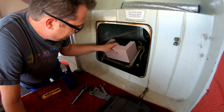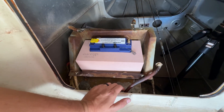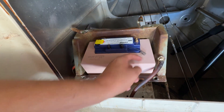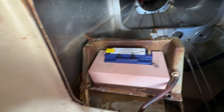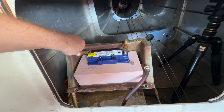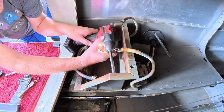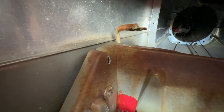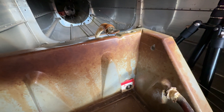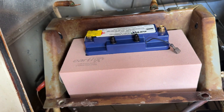So it's not hard from here. This is the old vent tube and we're going to be removing it — it's obviously terrible. We have to drill holes in the side of the box for the vent tubes to go out and then install grommets. That stuff was brittle and just kind of broke apart. I could have done that differently, maybe with a couple more stepped bits. But we're going to throw some grommets in there and make it good. Grommets in, battery back in. Next step is to install these guys on either side, and there's also some that go there and there.